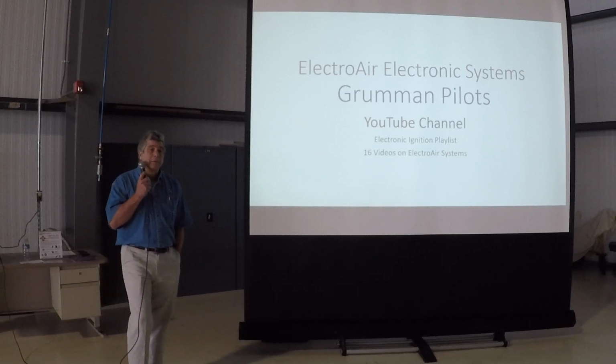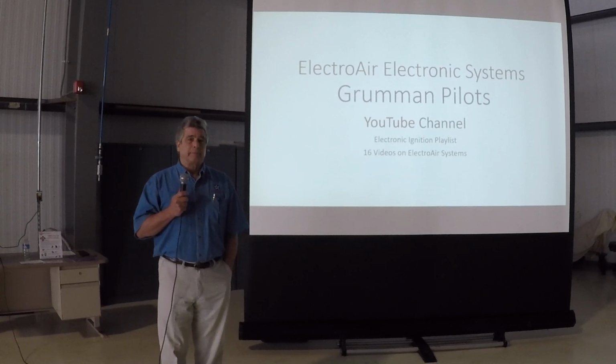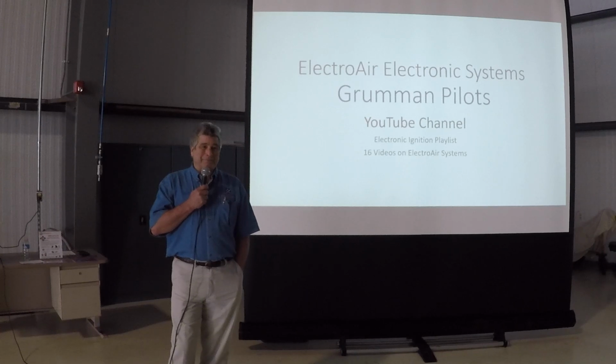So from the standpoint of wiring, the electronic mag, which would be the right one, would no longer be wired to the mag switch at all then? You have a separate switch on and off of the right mag, which becomes functionless. It's a dead switch then. And all you have is off, left, nothing for right, and start.